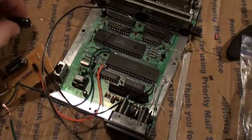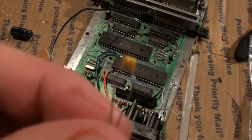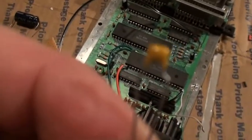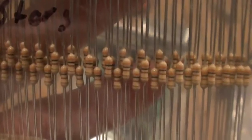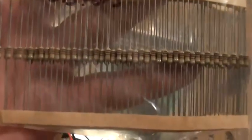These parts are actually very difficult to find at a Radio Shack, I'll be honest with you. I bought a pack of 100 and only one of them was correct. This is the 300 ohm 1/4 watt carbon film resistor — they're just straight up resistors. You'll need one of those. And you will also need a 110 ohm 1/4 watt carbon film resistor.